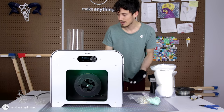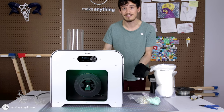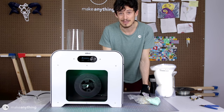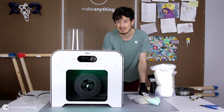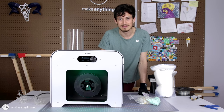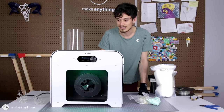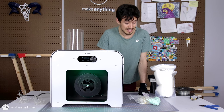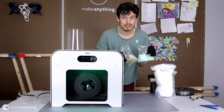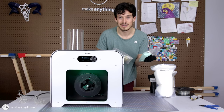This machine's been running for about half an hour now and it seems to be working pretty flawlessly with this PLA granulate. It's got a diameter consistency of plus or minus maybe 60 microns, which is equivalent to probably a really cheap PLA, but it should work on my printers. I'm pretty excited, so I wasn't planning to do this yet, but I'm gonna see if I can add some of my shredded recycled prints.